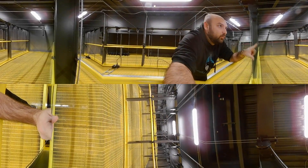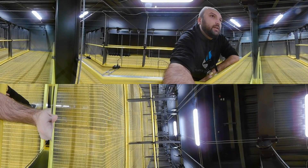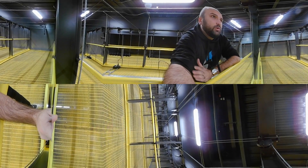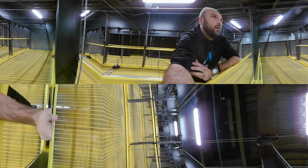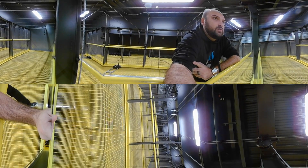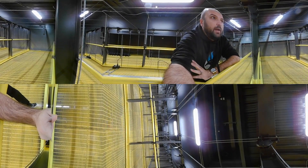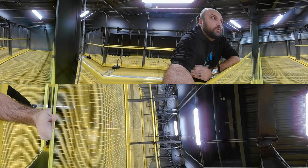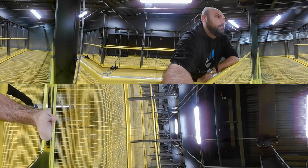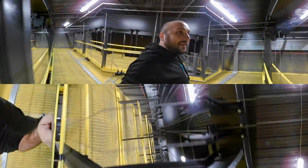If we take a look all the way down, we can count one, two, three, four, five, six, seven different pulleys all the way across the stage and across these curtains. Having seven pulleys is going to affect our force because with pulleys we're talking about mechanical advantage. If we have seven pulleys, we will have a mechanical advantage of seven, and therefore we're going to reduce our applied force by seven. So if we had a 140-pound curtain, we'd only have to pull with 20 pounds of force — a seventh of everything. This is rather impressive, just all the weight these pulleys hold up and how easily we shift them from side to side.